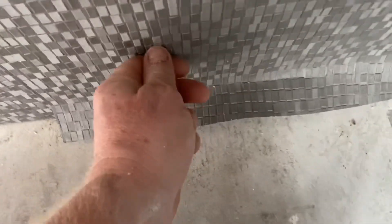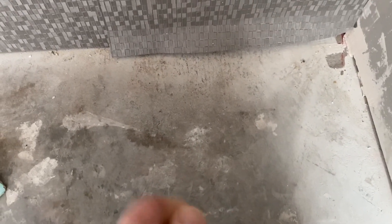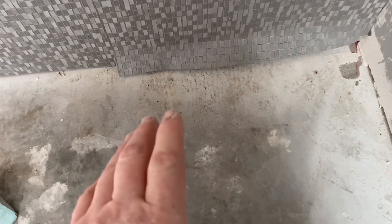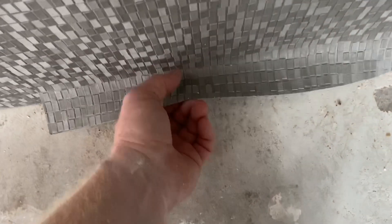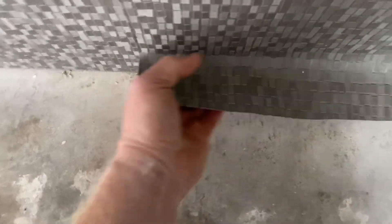Now there are two ways to do it. One is to pull the wallpaper out towards you, which is everyone's inclination. Or, to put less stress on the wall underneath, you could pull it straight upward to reduce pulling on the wall underneath it.